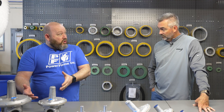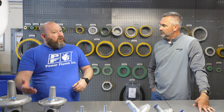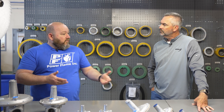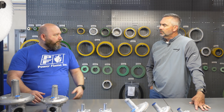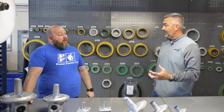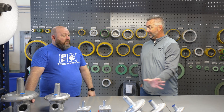They're normally sized for whatever the inlet pressure is and whatever the outlet pressure needs to be reduced to. Normally you'll have a high pressure coming in and you need to reduce it to a lower pressure for the burner to be able to operate. It's got to get enough CFH flow for whatever the fuel is going through it. The burner manufacturer is actually dictating that as they build and test them — that's for a certain PSI, and that's what the regulator needs to do.